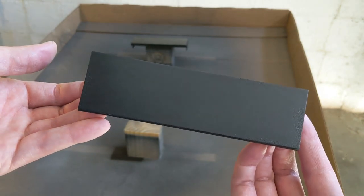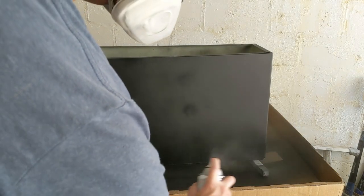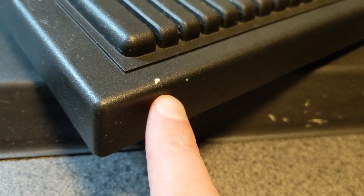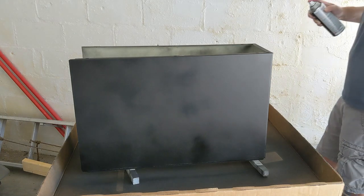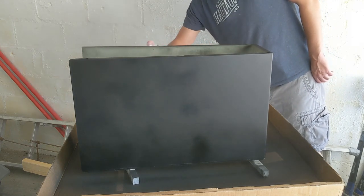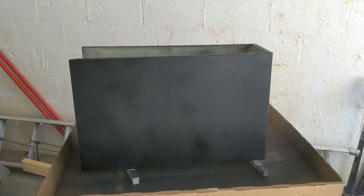Let's take a look at metal. I'm doing some patchwork here on the Tower of Doom build — the primer is already on there and I've got several layers of black paint already. I've sanded it down and I'm going to apply a couple new layers and then a new clear coat, hopefully making it more robust since I've had some scratching over the last few months from moving it around. On this metal case I've probably applied at least a dozen coats, waiting about a minute in between. If you wait more than half an hour to an hour, you should probably give it a couple of days, then come back, sand it, and apply more coats. Pay attention to the edges and corners as those tend to chip the easiest and often don't coat as easily as the flatter surfaces.